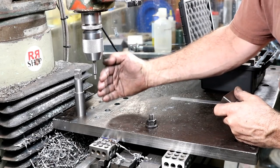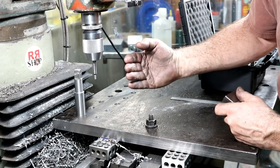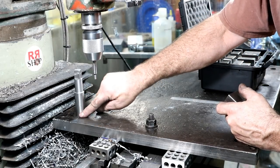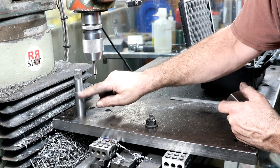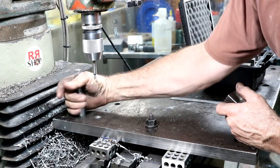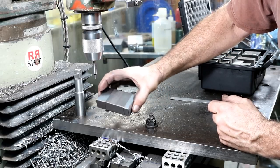All right, now I need to move my quill, my ram, over. Now I have no scales on my ram or anything, but I'm using this hole as my reference hole. So I screwed my pin in. Now this pin is right on the money at 1 inch. So that's really nice. And I'm using my Fireball Tool setup blocks